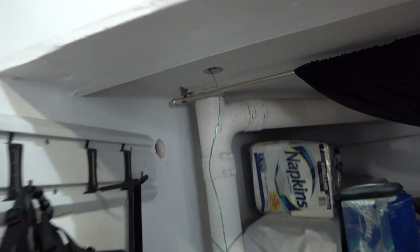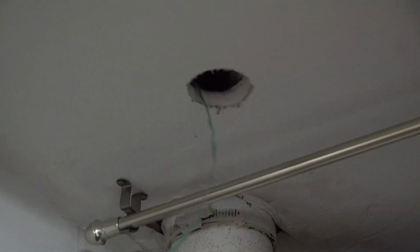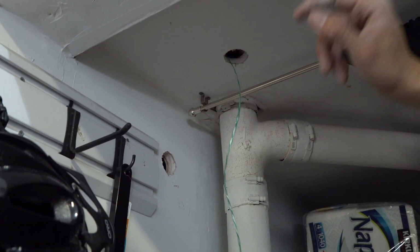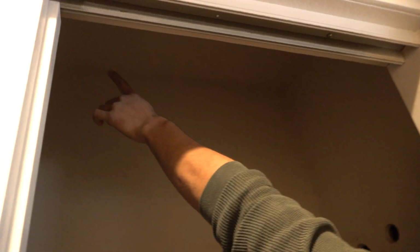So the focus of today was pretty much to find the wire path. So we came under here. We couldn't go here because of a fire block. So we found a path through here. And if we follow this here, it goes into a closet. The reason we had to do all this is because it's a 2-story installation. So from here, we're gonna fish the wire up the wall, put a little wall plate, route the wire on the ceiling. And then we have our other penetration up there, and that goes straight into a cabinet on the 2nd floor next to the chimney. All right, let's go check that out.